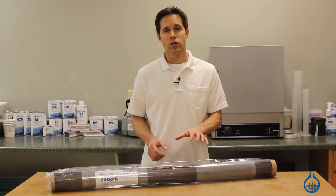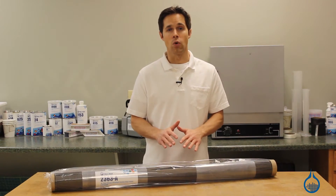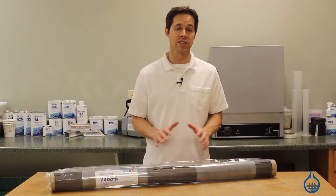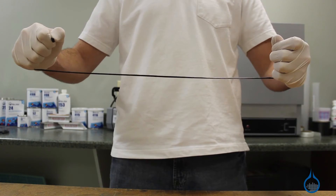The 1K tow used in this tight plain weave is the key to this performance. Each of the 1,000 carbon filaments that make up the tow yield the highest ultimate tensile strength in the industry — that's the force required to pull both ends of any length until it breaks.